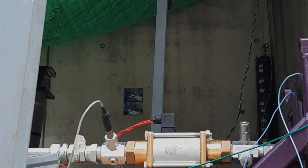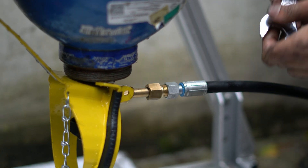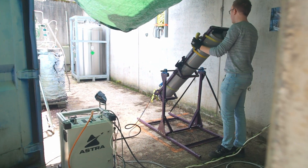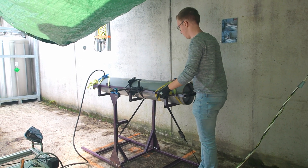You could just put your bottle beside your rocket, hook up a line, open up the valve, and boom — you're filling nitrous oxide into your tank. But there's a complication: if you do that, all you're gonna get is gaseous nitrous oxide into your tank. Nitrous oxide exists in two phases inside the bottle — it's both a liquid and a gas. If you just open up the valve at the top, you're gonna get the gas coming into the tank and the liquid is just gonna stay in the bottle. So if you actually want to fill liquid nitrous oxide into your rocket tank, which in most cases is what you want, you actually have to flip the bottle around. This way the liquid would be at the bottom where the valve is, and then the gas at the top will push the liquid nitrous oxide through the valve into your tank.